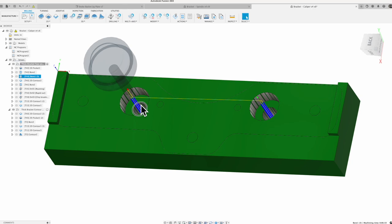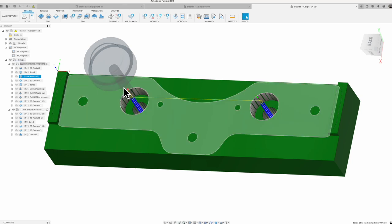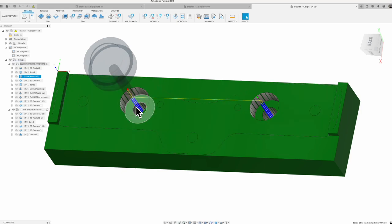And then once that's done, we're going to go through and bore the center of those out to go all the way through. Again, my cutter is only designed to cut 7/8 deep, is as deep as it will cut. But as long as I counter bore first, then I've got enough length to cut. I can get in there and bore the rest of the way through.